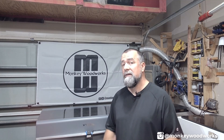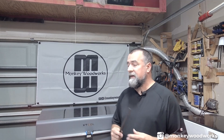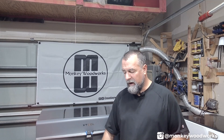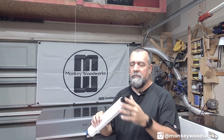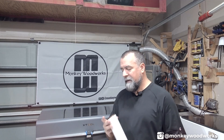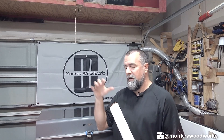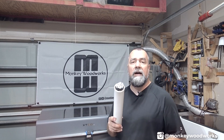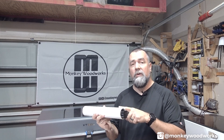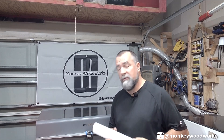Also speaking of slats, I found an interesting way to store them. I've seen other videos of people storing slats on the side of the riser base, but you're still kind of just throwing them in there. What I found is that a two-inch schedule 40 PVC pipe does a really good job of holding all the slats. I had this piece here, put a piece of quarter-inch plywood cut on my P2 and glued it on there with E6000. This is how I store them — they're not just falling everywhere, and it does fit all of them. You can buy these in two-foot lengths if you'd like.